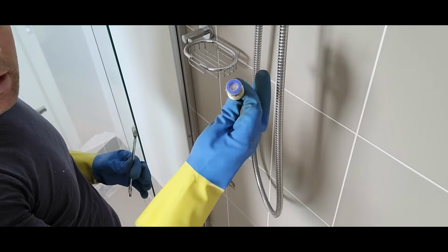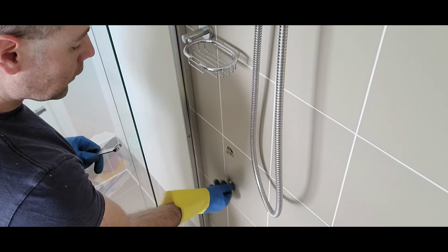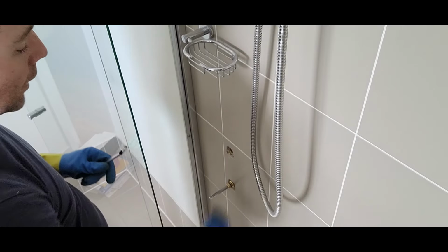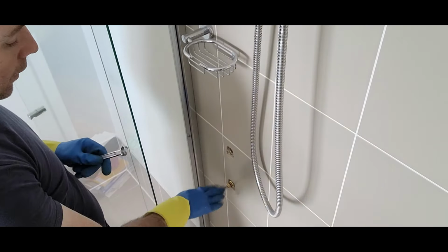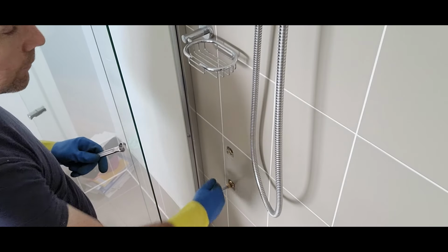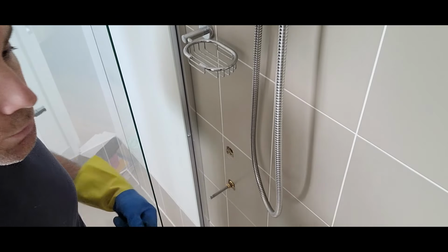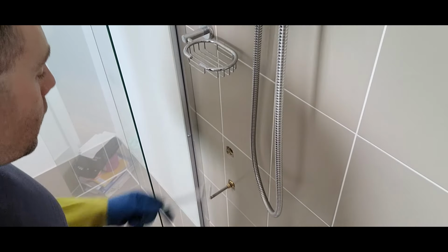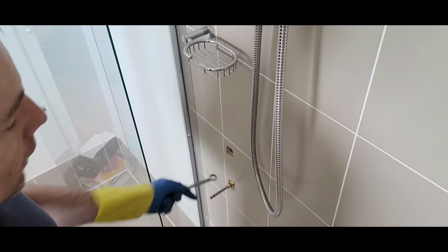All right, so we've got the cold water tap here, which traditionally goes into, well, should go into the bottom. Although at my mum's house, which is a Beechwood built home in 2004, they're actually reversed. In the main bathroom only, not the ensuite, that's done correctly. So they installed the hot water tap on the bottom, cold on the top, but labeled the taps hot and cold. And when we moved in and had our first shower, we were confused as to why there was no hot water, and I thought it was a gas hot water system that hadn't been switched on, like the burner hadn't been switched on. But no, we discovered that they actually installed them in reverse despite labeling the taps correctly,